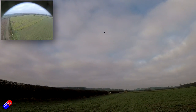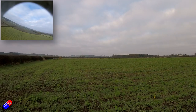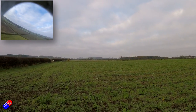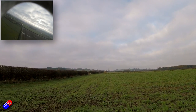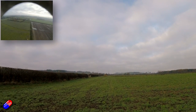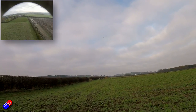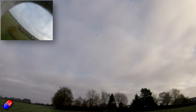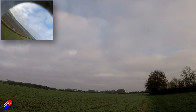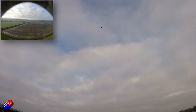Once it's happy it's flying, the rear prop stops and you're just flying in fly-by-wire A mode. Very small current draw - only a couple of amps. These are large, relatively slow props on a big flying plank with a lot of air surface. It's very easy to fly and appears to be trimmed pretty well. Once in fly-by-wire A mode it just behaves like a very well-behaved flying wing and is a joy to fly - no real drama at all.